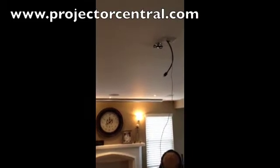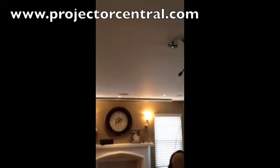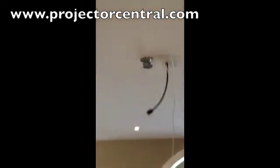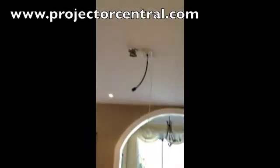I phased out where the projector was and found the distance of 12.1 feet for our projector by going to ProjectorCentral.com and using their calculator. Tell it the screen size — 120-inch screen — and it tells you the throw distance. So we've got that mounted; I custom-rigged the little mount up in the attic with the wires coming down.